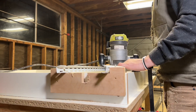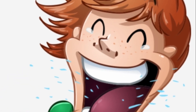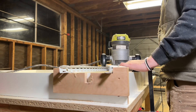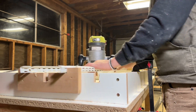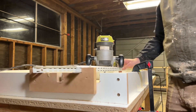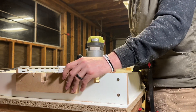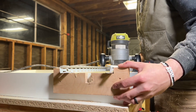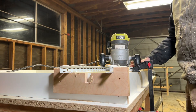Oh no, mistakes were made. As you can see, I shouldn't have cut the slot into the guide box — I should have just cut it into the stopper. This is okay because it's still effective as a sled. Since I built the guide box big enough, I can always cut it shorter and remove the notch later.